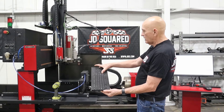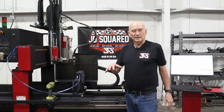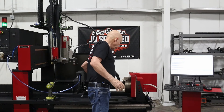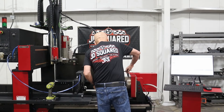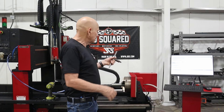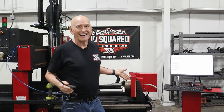In case you're wondering, the machine has three speeds. You hold down the arrow keys — this is slow speed; shift plus arrow is medium; control shift is fast. Let's go ahead — we've got a piece of round tube here. I'm going to place it into the chuck. It doesn't need to hang out a long way because we're moving the stabilizer very close to it anyway. Now, do not leave the chuck key in the chuck because this machine has a tremendous amount of power. If the chuck rotates and hits something with the key in it, it's going to snap the belt inside. So we've just procured a bunch of self-ejecting keys so that you cannot accidentally do that. We'll be sending them out as we get more in — it's a free upgrade, something we should have done day one.